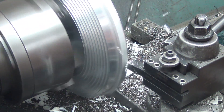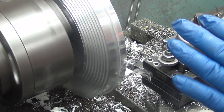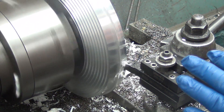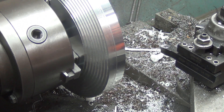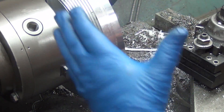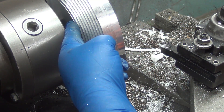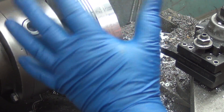It's like 40 thou. This is like 3.5 thou per rev. I let it run on there a little bit so we can see how close it is. That's pretty dang close — it's within a couple of thou, concentric-wise. Okay, now I've got to cut the face off this far enough down to meet that hole, then trim up that hole. I'll have a flat spot here with a hole that is concentric to that. Close — it's a 3-jaw.